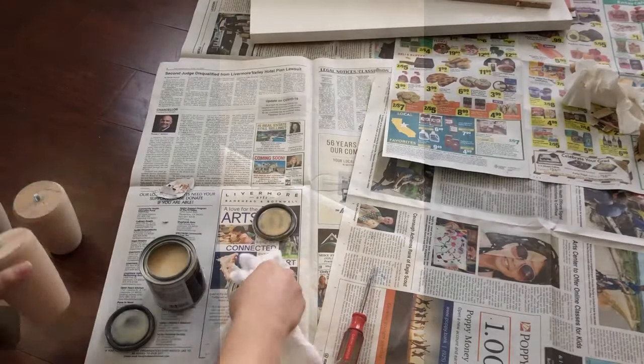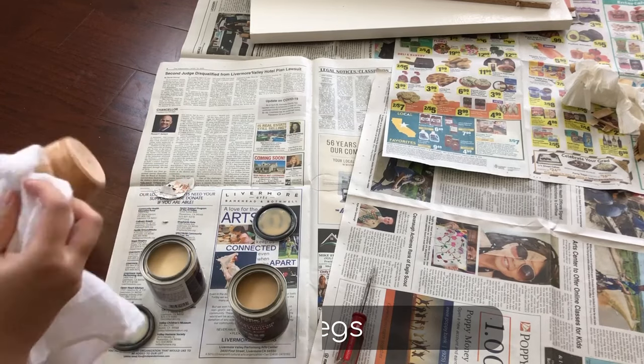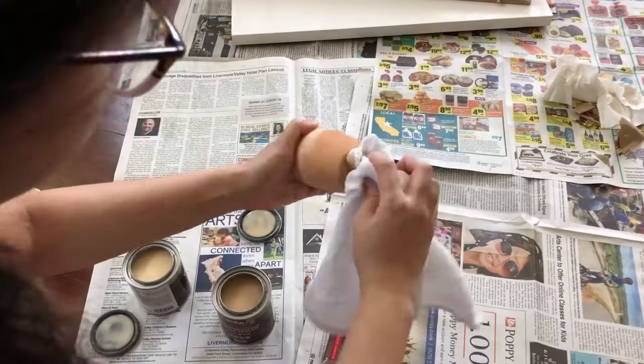So I'm now hammering in 4 T-nuts into the bottom panel of the nightstand so that I can attach my furniture legs onto it. Next, I'm going to be staining the 4 furniture legs that I have from the hardware store. They're unfinished, and I wanted to make sure that they were the same tone or at least the same hue